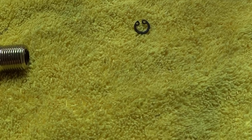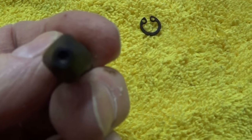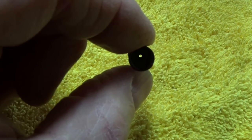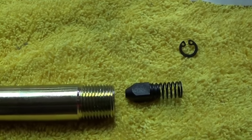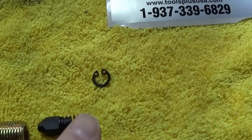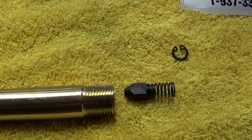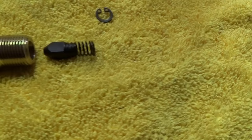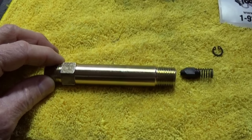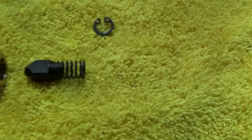When you want the lift to come down, you hit the release lever, but the fluid pressure pushes this valve all the way in and seals it off. If there's any kind of blockage in this little tiny hole — and believe me, it can be a very small piece of debris — it will not come down on either side because of how the hoses are arranged. It's just trapping the fluid in there, and the lift will not come down. So the first place to check if it won't come down is the non-power side stem. Take this little piston out.